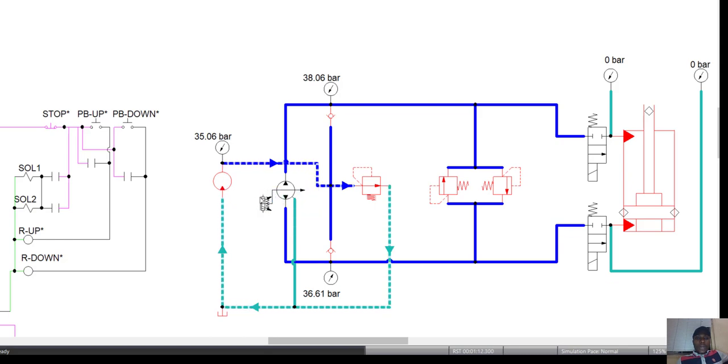For a closed loop hydraulic system to work, there must be a feed pump supply — that means another pump must supply pressure to the system. This is called the feed pressure system. The feed pressure is supplied from another pump entirely, which most of the time is a unidirectional fixed displacement pump, and this pump will supply both the high pressure and the low pressure side of the variable displacement pump.